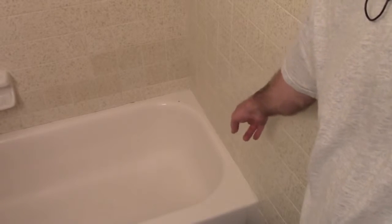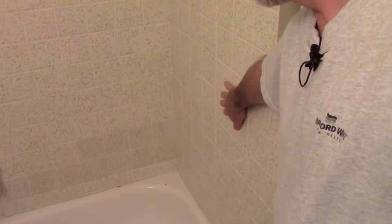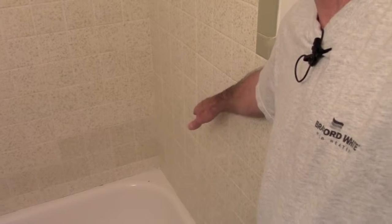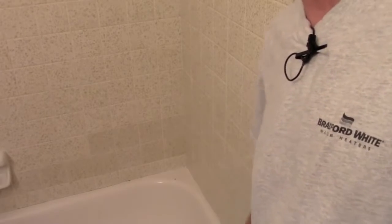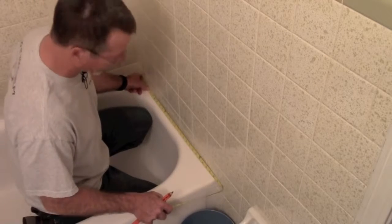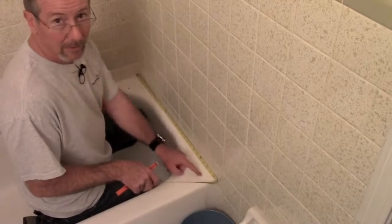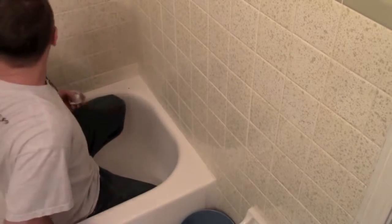This is the end of the tub — we're going to put one bar here, about right here. I'm going to try to center it on the tub. You will also need a measuring tape. The first step is to find the location for the bar. This tub is 28 and a half inches from the corner to the edge, so the center is going to be 14 and a quarter inches.